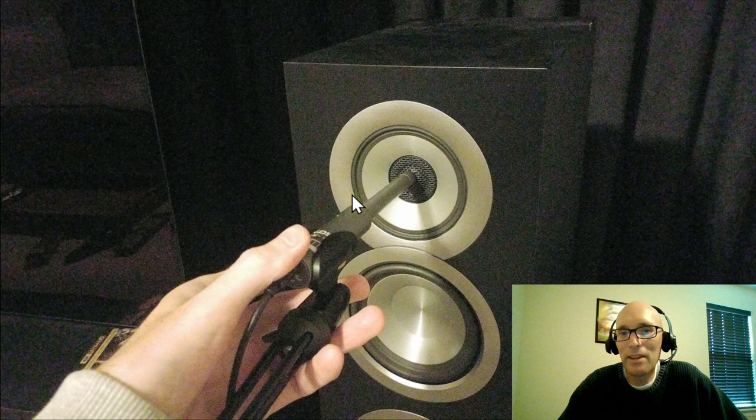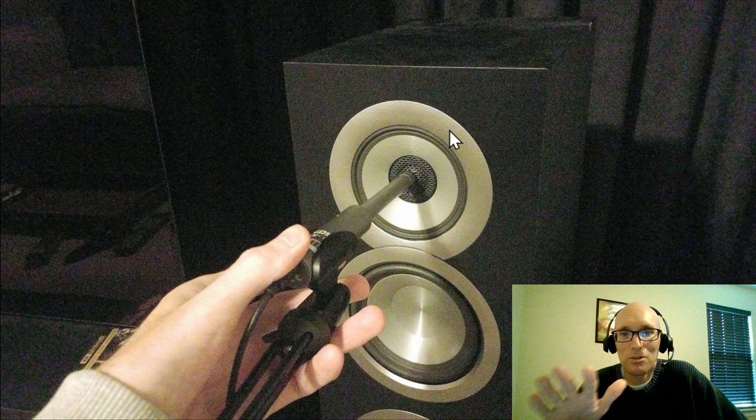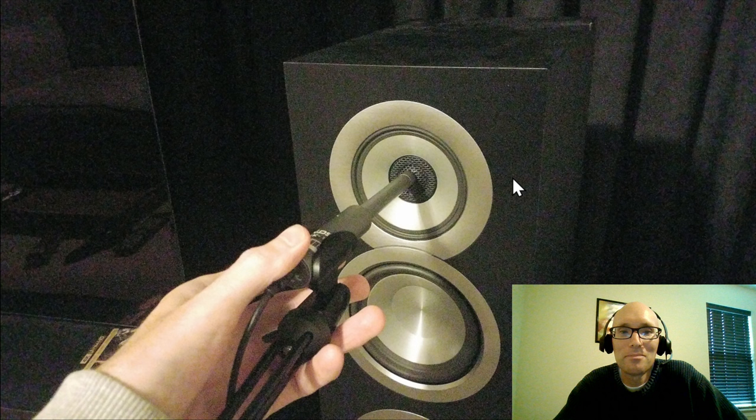Now this is my right speaker here, and versus my left speaker, same speaker, this speaker measures slightly bright, and I've actually measured it with REW, and it is slightly brighter. Now there are things I can do to change this. I could EQ just this speaker if I wanted to. I could probably put some type of curve onto it just to gradually lower that. I haven't done that, but there's a lot of things you can do